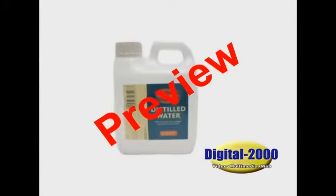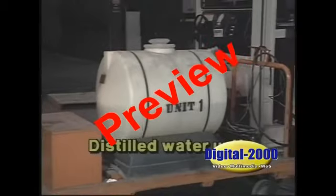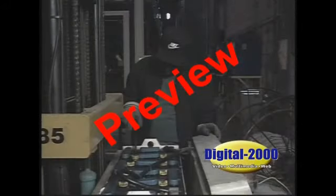The reason for this is simple. Distilled water removes impurities in the water. Using regular tap water in batteries causes these impurities to attach themselves to the battery plates during charging or chemical action and can cause the battery to decrease its normal life expectancy. Use distilled or other approved water when filling batteries. Don't use tap water because it will cause the life of the battery to be decreased over time.